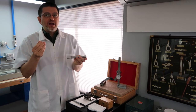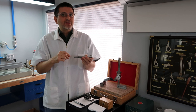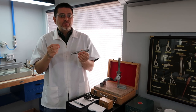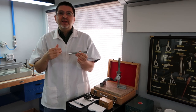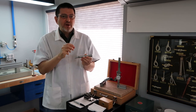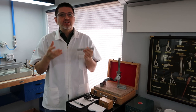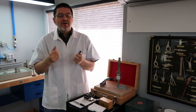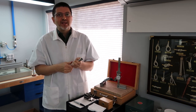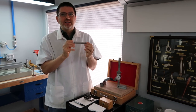And the third factor might be the biggest one. Really important one too. Remember, this spindle is used in a micro machining precision environment. So that means these machines aren't being abused. They're machining very precise tiny parts, and even the motors that are driving the machines are fractional horsepower motors. So all of those things contribute to very minimal to no runout, we think. But just the workmanship, I mean, it's class A1 workmanship.